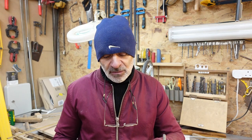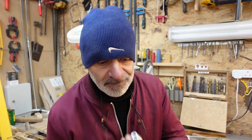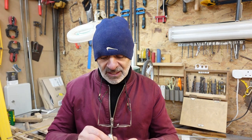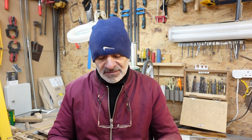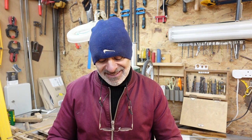They only open up to 3.5 millimeters, and the arbor on the mainspring can be about 4 millimeters, even a little bit bigger. So as I say, I got lucky with this one, which was off of a hand drill thing, and it's got an opening of around 6 millimeters, which is perfect. I don't know the answer yet, but I'll think of something.